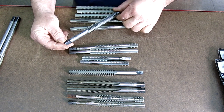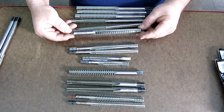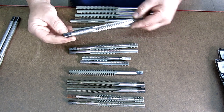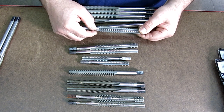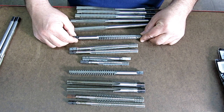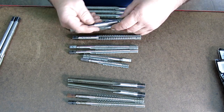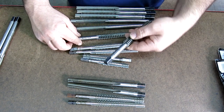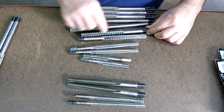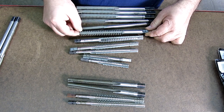There's a bunch of square threads here, and then this is a 3/4-5 square thread. Because it has this pilot and the thread starts at zero and then ramps up, this looks like a roughing tap — although it does not say 'rough' on it. I would say maybe we're missing the finish tap. Here we go — so these two would go together as well. You can see the square profile on the finished tap. Here it almost looks like Acme because it's a roughing tap just making room for the finish tap to come through.